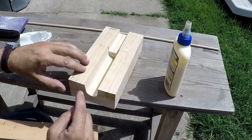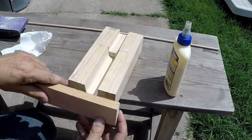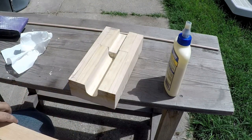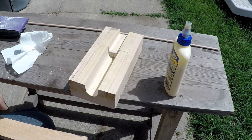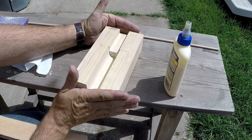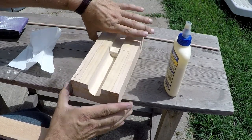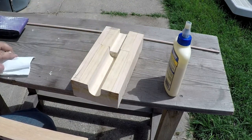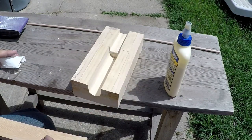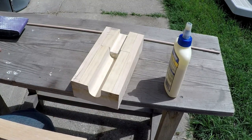When we're packing sand in here we need this to be flat, so we've got a piece of wood — we just need to make a couple of caps that go on both ends. They'll be doweled the same way, so this whole box can just be slipped together and you can put a clamp around it like this — maybe clamp one this way too. He's going to put a coat of paint on it, and that'll slick it up really nice so it should be pretty much good to go.